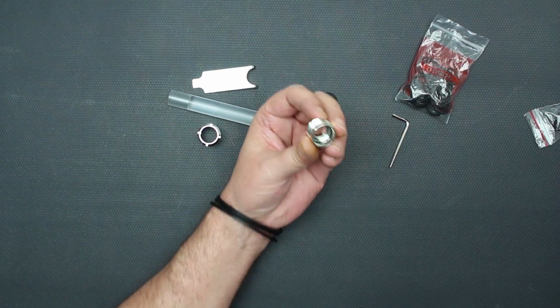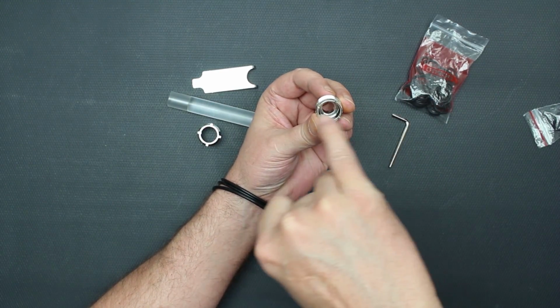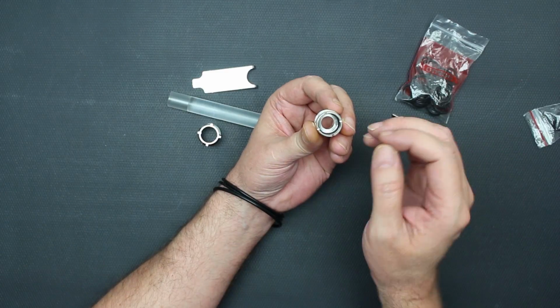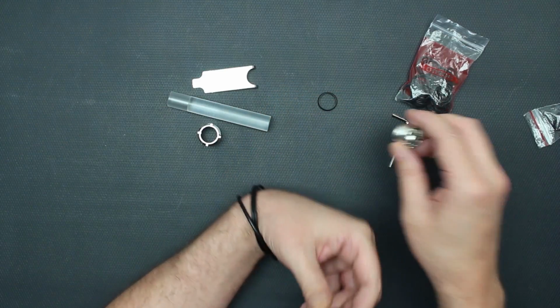One area of concern that you'll come across, the bottom O-ring, there's a groove, and then right below that there's the flange where the tube rests. I wanted to make it so that it was really obvious when the tube bottomed out, because that's kind of important. Make sure you don't accidentally install the O-ring down in that flange. You'll be able to tell when you've got it in there correctly.